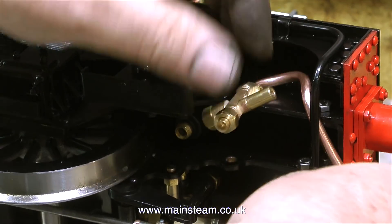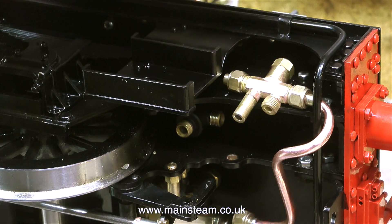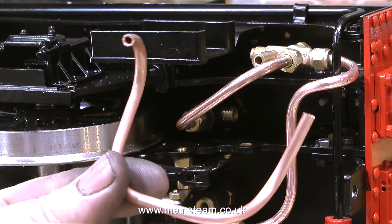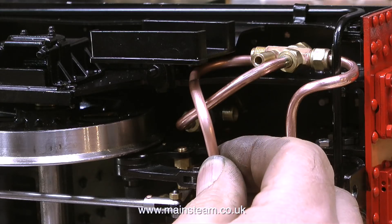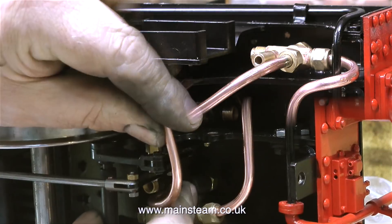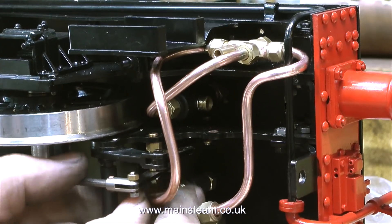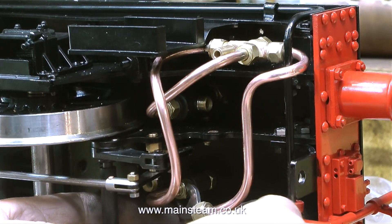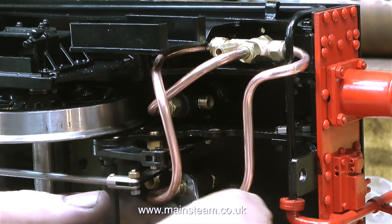Now the main piping begins — this is the real piping job, and it's going to get increasingly difficult the more piping gets put in this area. The pipe I've just added is the injector feed pipe from the water valve. This — when I've finished bending it, and it's been quite difficult, this was actually the second one I made — connects the injector to one of the check valves on the block. I always do things freehand; with practice I can generally get the bends somewhere near. But copper work hardens, so once you bend it wrong, you have to anneal it. I bent it wrong a couple of times, thought I'm not going to bother annealing this short piece — so I cut another bit. That's why I bought a lot of it at the beginning of this episode.